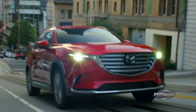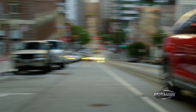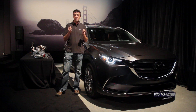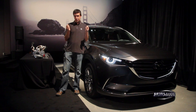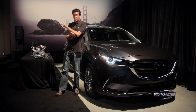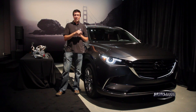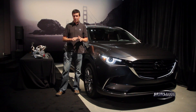We know if you're on a hill because if you're sitting still and we see positive G on the G-sensor that the stability control uses, that means you're on an incline — on an incline you have less weight on the front wheels, less grip, and more likely to need all wheel drive to get going. We can also directly measure the amount of grip on the surface. The electric power steering has torque sensors and steering angle sensors, and if you're going around a corner and hit a puddle, we can measure exactly how light the steering gets at much higher resolution than you can, measuring precisely how much grip is available. We can tell if you're on dry pavement, snow, or wet pavement and react accordingly.